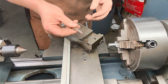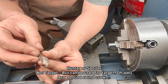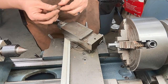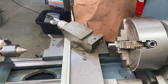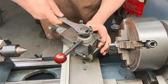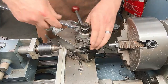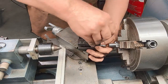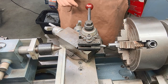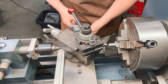This is our crowning bit. This is for doing a hunter crown, which is kind of your typical rifle crown that you see when you buy a non-target-specific rifle. I ground this particular bit quite a while ago and I use it for the contours. I've adjusted the height of my cutting bit to make sure it's at the center of our workpiece, and now I'm going to start by cleaning up the end of the barrel by making a couple of cuts with my square cutting bit perpendicular to the bore.